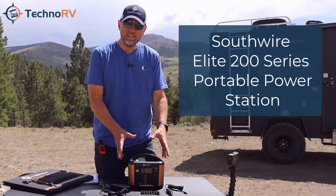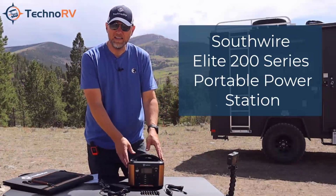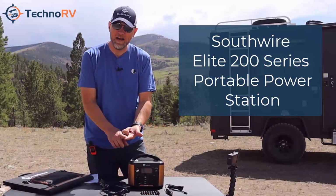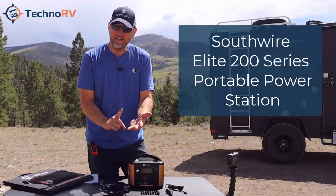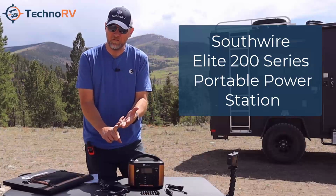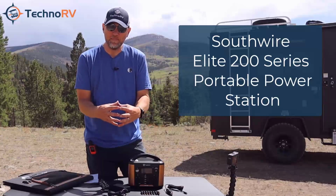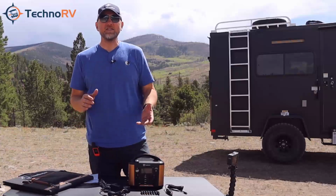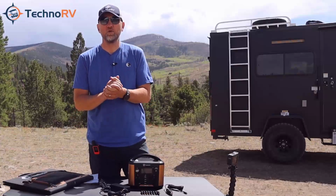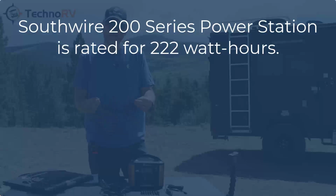So this is the Southwire Portable Power 200 model. Again, this is a UL certified lithium-ion battery, pure sine wave, which is what you want, and it does have that built-in inverter, which is going to allow you to get AC power in addition to DC power. Now, this is actually a 222 watt hour unit, and I want to explain what that means.